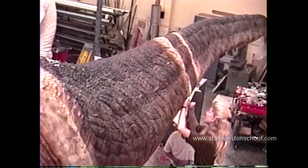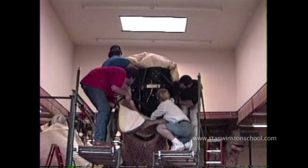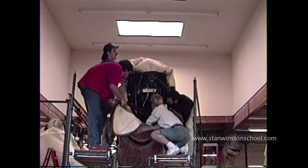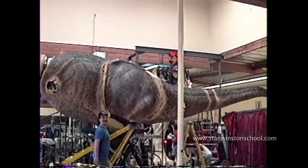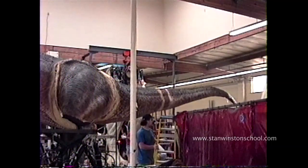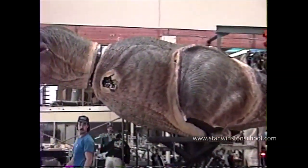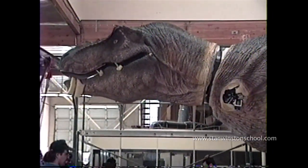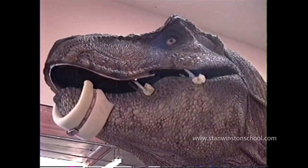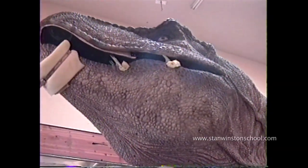Tremendously heavy. These skins were two inches thick in a lot of places because we wanted to make sure that they didn't give away the mechanisms inside. That's kind of the wonder of the fabrication and the coring — inside you've got hard mechanical moves, but on the outside it needed to look like smooth, organic, realistic movement. A thicker skin always helps with that. But as we learned later on, a thicker skin takes on more water, it shrinks more, and it's just heavier.